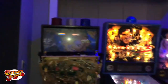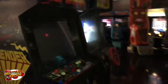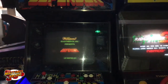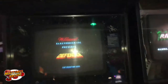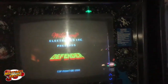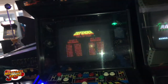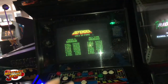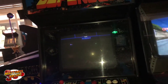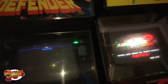In comparison to my other DeWalt lights, the batteries actually last the exact same so I'm not even going to complain about it. This game is kind of new to the floor — we had it out here when we first opened but there was no red and there was a lot of glitchiness. I cleaned the board and all the connections — we had some oxidation on the header pins and connectors. Once I went over that and cleaned everything up, it all popped back up. There were no actual problems with the game.